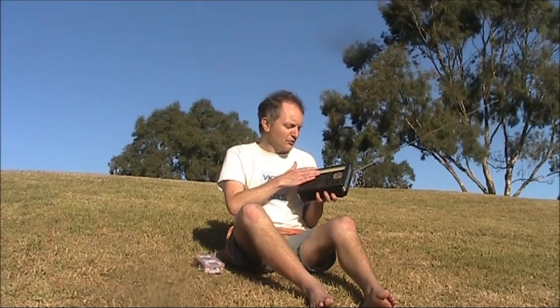What am I going to do for a receiver? Well, I'm going to go really simple. I'm using a 1970s era National GX3. It's just a very basic AM, FM, shortwave broadcast receiver with no BFO. And shortwave is several megahertz over the whole dial span. So it's not the greatest of receivers. Neither is it very selective nor sensitive.